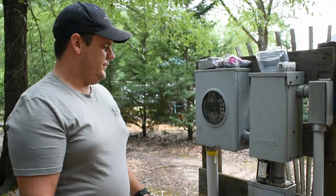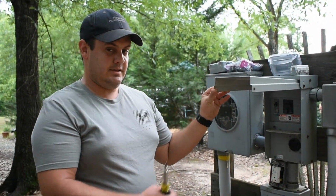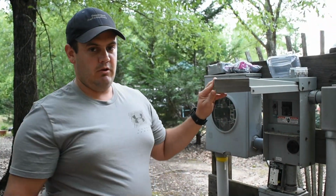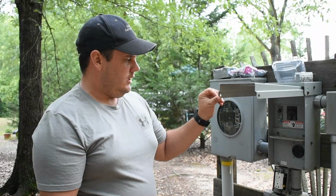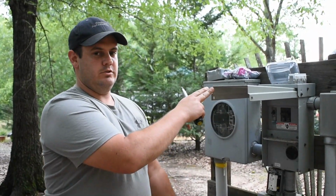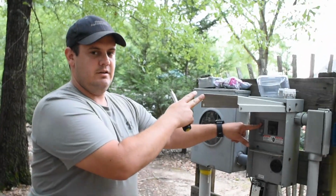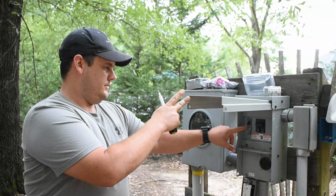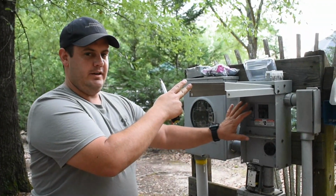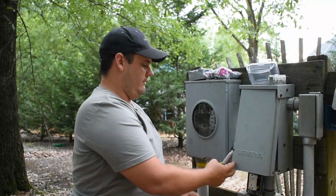So what we're going to do first is just basically take all this apart, and I'm going to redo everything. So I'm going to try to bring you along as I go. So the first thing we want to do, like I do every video, every time we work on electrical, is we always disconnect the power and make sure it's off. And I already checked this with the meter earlier. So just make sure you verify the outlet, and I've already done that. But this is my breaker, I have it off, and now I can tear everything apart here.